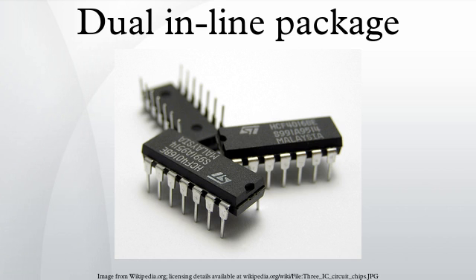Some other types of DIP devices are built very differently. Most of these have molded plastic housings and straight leads or leads that extend directly out of the bottom of the package. For some LED displays particularly, the housing is usually a hollow plastic box filled with hard translucent epoxy material from which the leads emerge. Others, such as DIP switches, are composed of two plastic housing parts snapped, welded, or glued together around a set of contacts and tiny mechanical parts, with the leads emerging through molded-in holes or notches in the plastic.